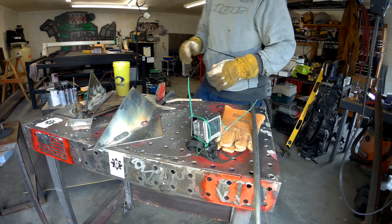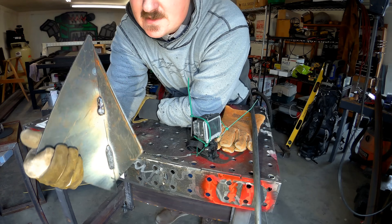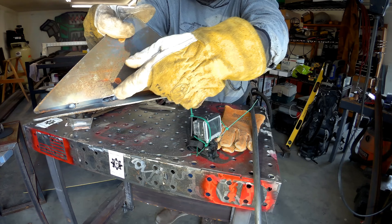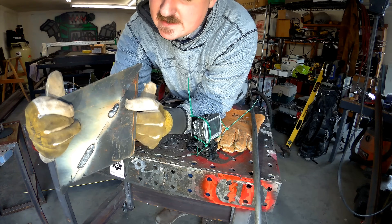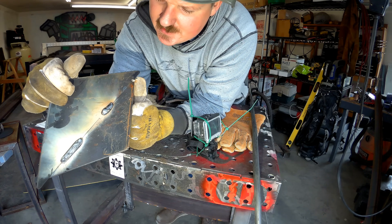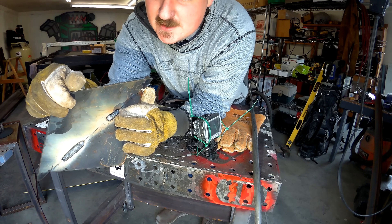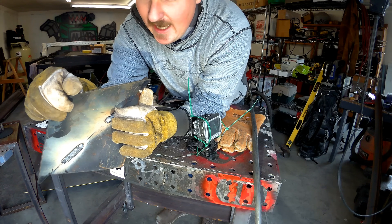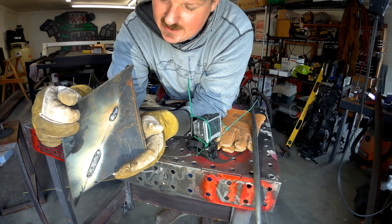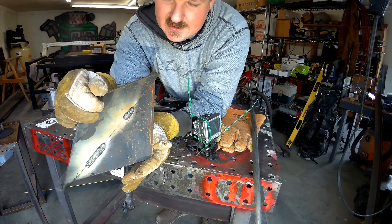That's the perfect example of way too much heat. On the back it totally blew through — no slag coverage whatsoever, the slag couldn't even keep up. This is basically an unshielded, way-too-hot, not-enough-wire-speed, shitty weld. I had to go through a lot of these before I figured out how to weld proficiently, and even more to start doing code work. Just be patient with yourself — this stuff doesn't come automatically, it does take a little work to figure out.